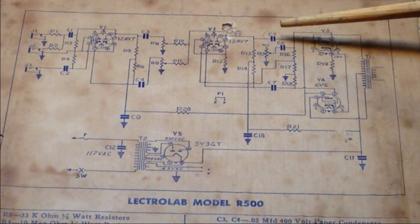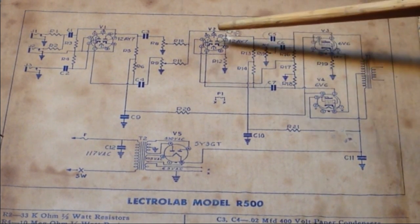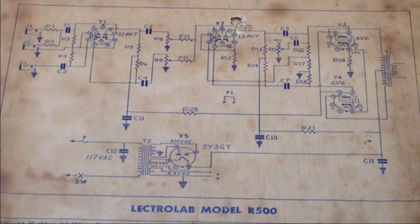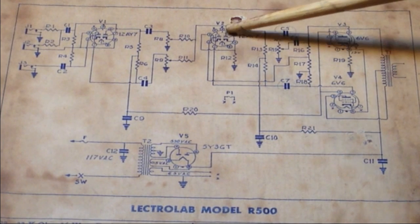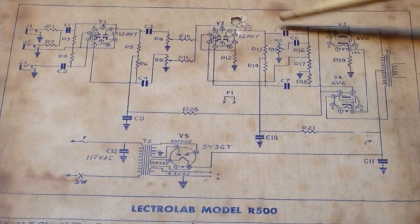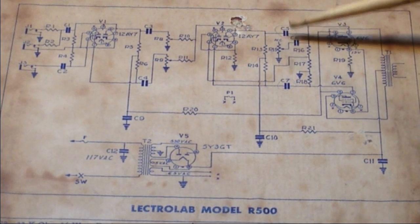But it looks to me like, let's see, here are our coupling capacitors. The phase inverter looks to me like something called a floating paraphase inverter, which has some characteristics. You can see here the signal that gets mixed together comes into this stage here. So we can call this the positive phase, which goes directly to this 6V6 through your coupling cap.